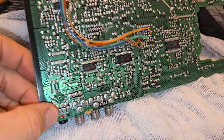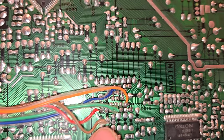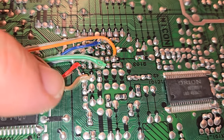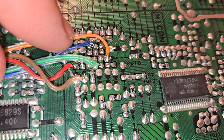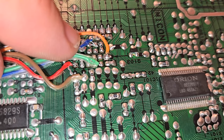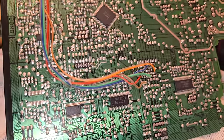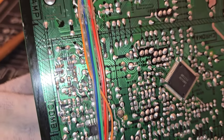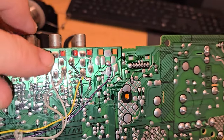This is our chassis that you've seen me work on now. And if we look over here, this is that area. I went in and removed all those six components right there. And then there's the green, there's the red, there's blanking. I actually added this orange ground. It's an additional ground on the pinout, and there's blue. Now, that's all good. I checked all that, made sure nothing was shorting to ground or to each other, and it's not. I did add a little bit of sticky glue.